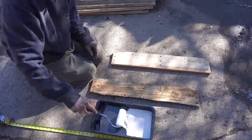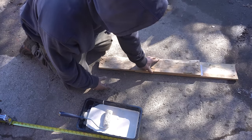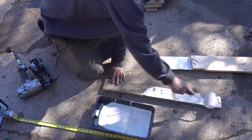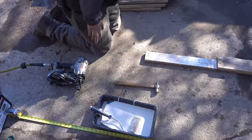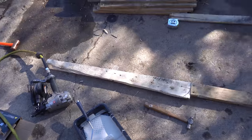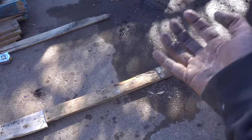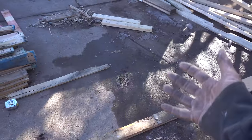Here's my plan to make usable lumber out of these pallets. I'm going to take each of these pieces, cover them in glue, then line up one edge, nail them together, get the next board ready, get them glued together staggered until I get to a length that I want — and rinse and repeat all the way to the end. Just like that. And now, as you can see, we've got a very high quality, beautiful 2x4. The nails are just to hold it together while the glue dries, and I'm hoping the glue will do a lot of the heavy lifting.